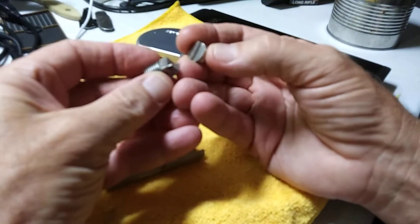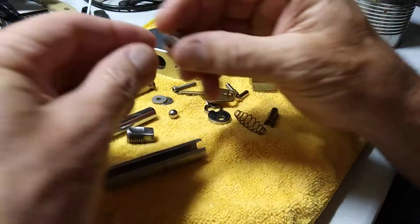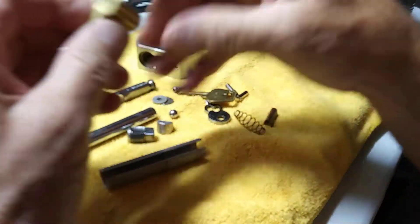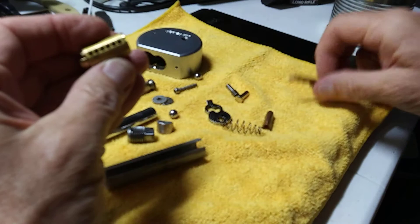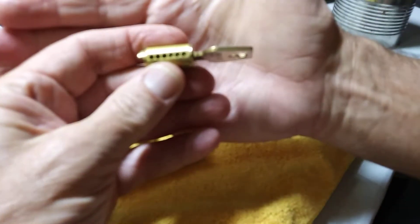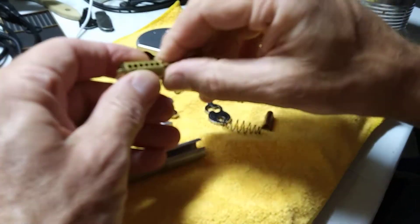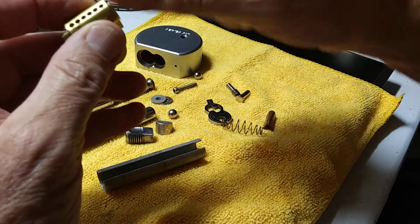I'm producing my own actuator — I don't know if you guys can see that or not, but it's made out of a half-inch pipe plug. I'm using another top part of a Brinks actuator and a Brinks-style core and matching plug. When I say matching plug, I mean the plug actually matches up exactly with the bores that go into the bible — there is no sloppiness. The holes are perfectly drilled straight through the plug into the bible with no slop.